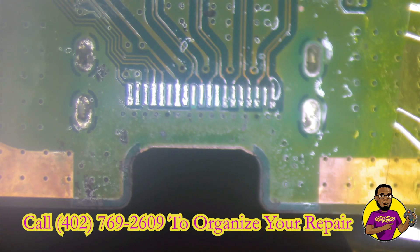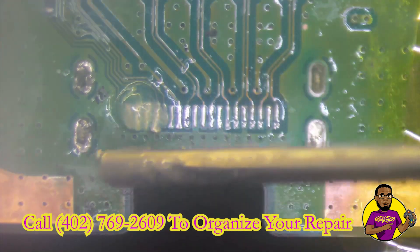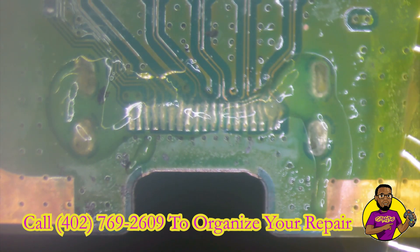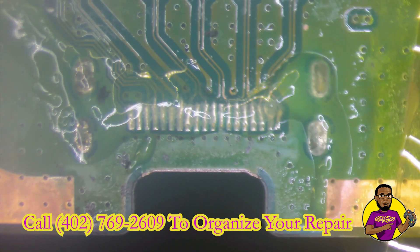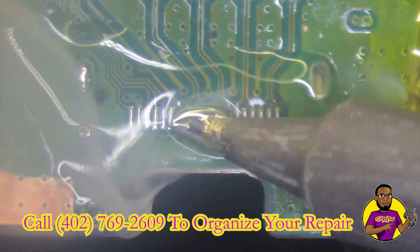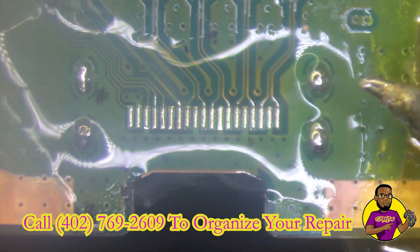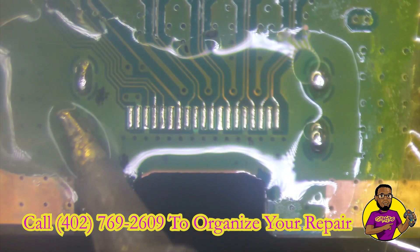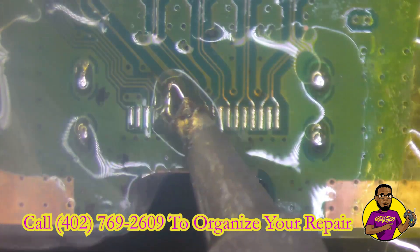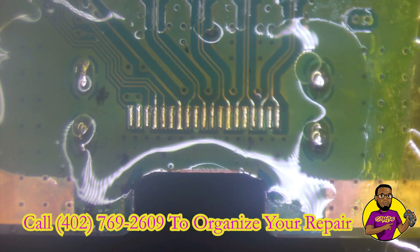Now I'm putting my gloves on and turning on my fume extractor. Now we're going to take our 8341 no-clean flux and put this on here - the flux helps load the solder to make sure we can get it on there. We're going to take our solder wire and our Hakko soldering iron and just go ahead and start soldering, going completely across the header and getting new solder on all the pads. Let me hit that up a little bit more, add a little bit more solder. That looks good.